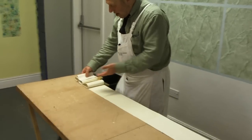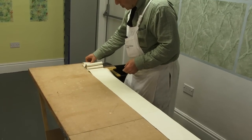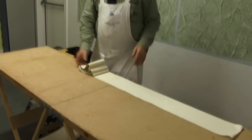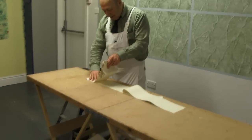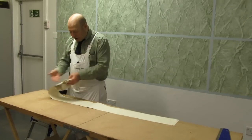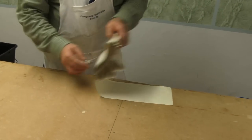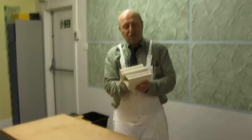We've got the strip and we're going to turn it back into a concertina fold so we can take it across the wall. We don't want big, clumsy folds — we want a nice, easy, relaxed fold size. For me, that's a nice fold size. If you were putting a border on the wall, this is the same principle — nice little folds, straightforward. The border would go on exactly the same way. At the end, fold it over and we'll go and put the strip on.